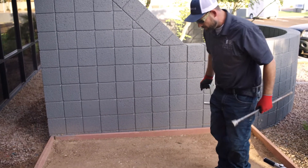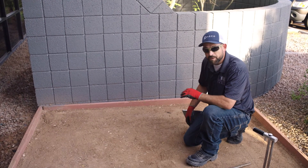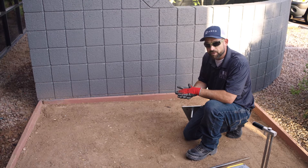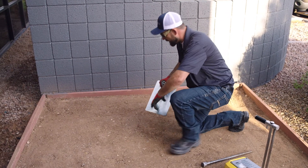We've got a rod guide at our location where we're going to be performing the test. We're going to want to make sure that we have maximum surface area contact with that nuclear gauge, so we're going to prep an area and make sure that it's as flat as possible.